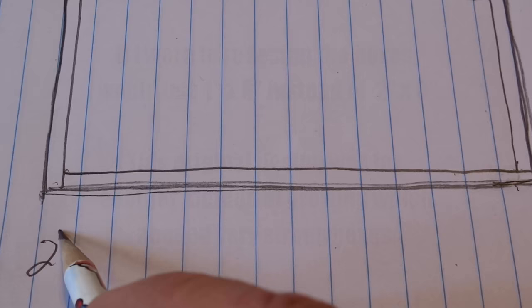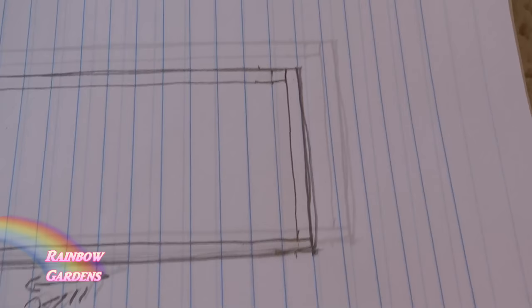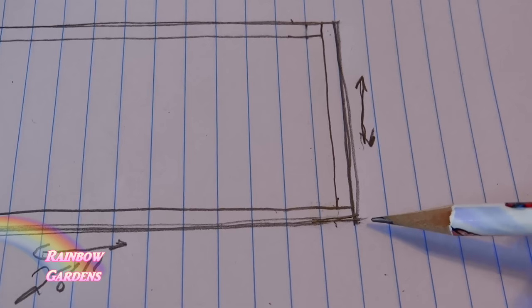Since I'm interlocking it, that'll be two inches, plus I need to get 30 inches out of here, so one length will be 28 inches. Then on the other side I need 16 inches total — so again I have the two inches which is the depth of the lumber.